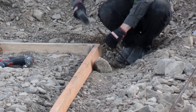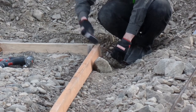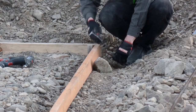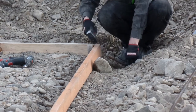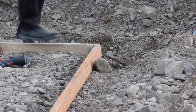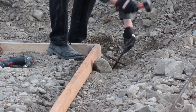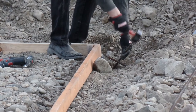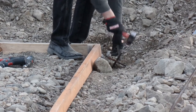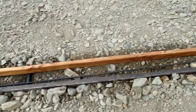The footer that I've designed for this greenhouse is not to any code — just the Lawler code. It's tiny, and I'm a little concerned about the building blowing away, so this is a little bit of insurance. I've just driven a chunk of rebar into the ground, and then the concrete is going to get cured around the top of that, while the bottom is actually stuck into the ground quite a ways. Honestly, a bigger footer would be a more reliable way to get more ground contact. Apparently this is not done very often because in a lot of soils the rebar will rust away and then rust its way into the concrete and make a mess. Luckily our soil is super well-drained here.